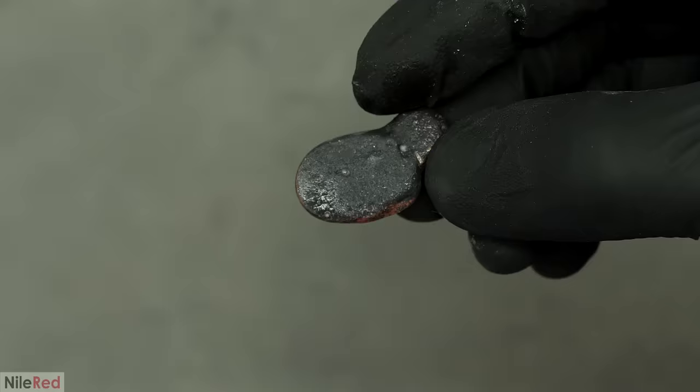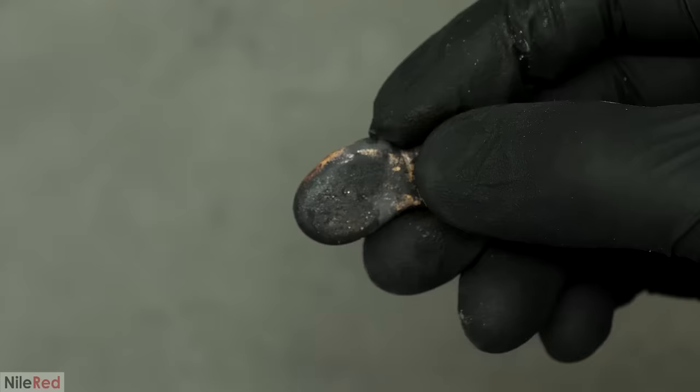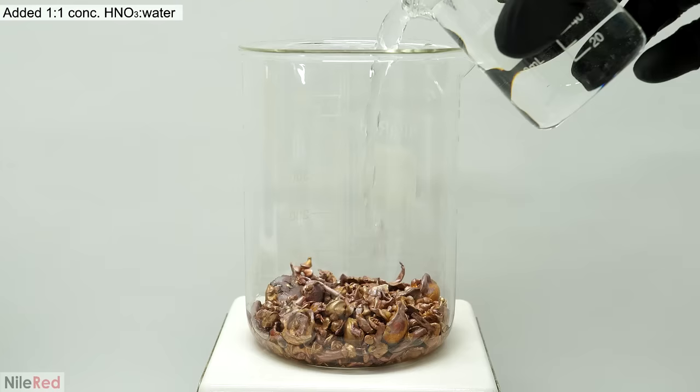In the can, just sitting on the fiberglass, I also found this chunk of alloy which had leaked out the side of the crucible. So I took this along with all the flakes and I put them in a beaker. Then, on top of all of this, I poured in some dilute nitric acid.